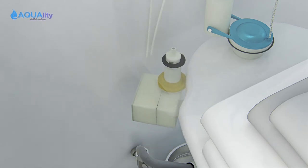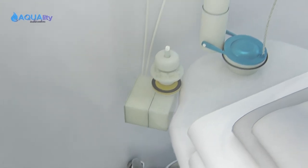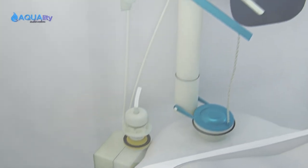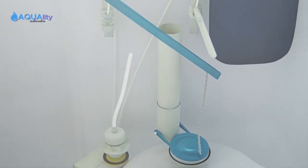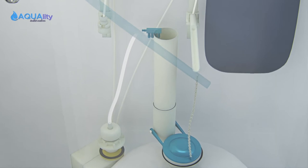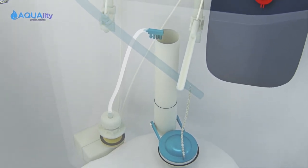Now you can insert your new Zero Waste Toilet Water Valve from the bottom of the tank. Connect the vinyl hose from the valve to the cycle diverter, which diverts water from the bowl to the tank, saving an extra half-gallon of water per flush — in addition to the one gallon of water per flush that the bag will save you.